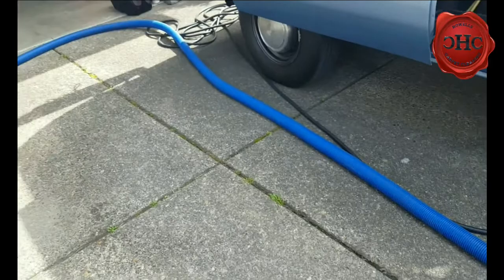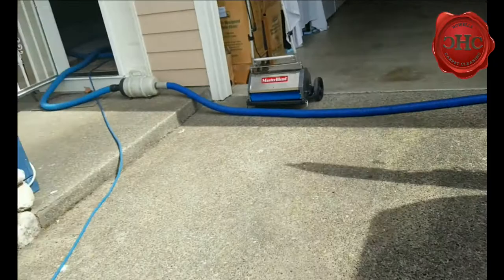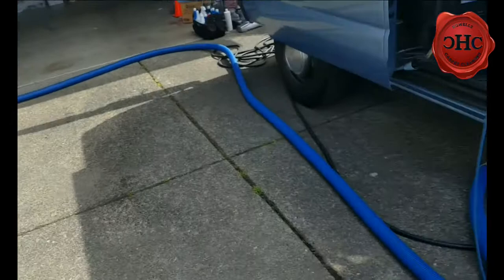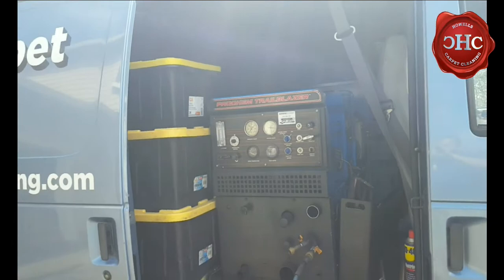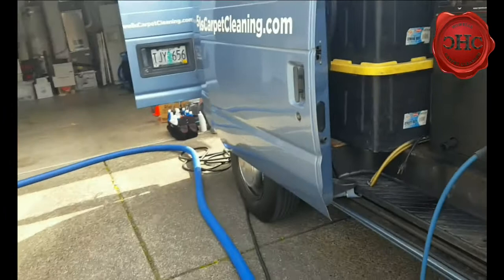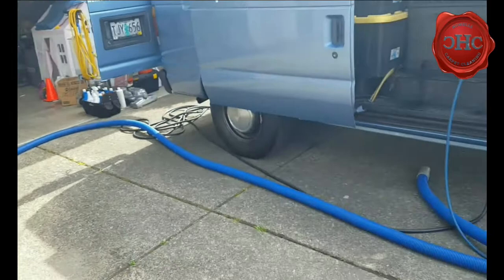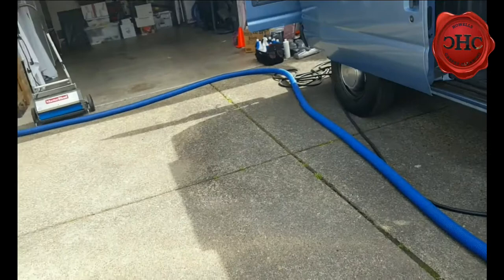Providing this really long on-ramp so things can get up to speed once we hit this little speed trap helps your airflow immensely. I haven't actually done this yet — I know I've done it without thinking about it, but now with it in mind I want to calculate airflow and all that. I have a feeling, just doing the math, reasoning, and physics, it's going to help immensely, especially when dealing with — this is a Pro Cam Trailblazer, 16 horsepower of raw power. With the smaller motor and smaller blower, I've really got to milk it for as much as I can.